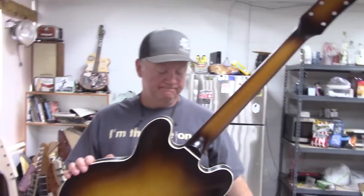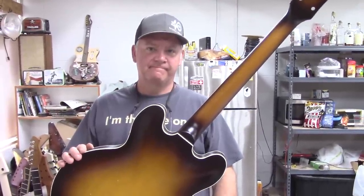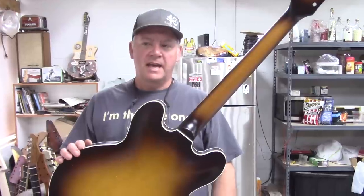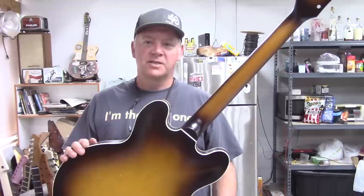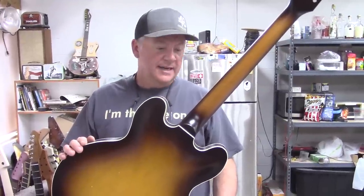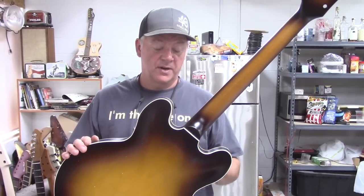All right, Chris, there are going to be people who ask, what about that guy who works for Gibson who uses bits of old bandsaw blades to scrape with? Yeah, I was thinking about him when I was doing it. I think this is one of those things where the longer you practice, the better you get at it. I don't have any bits of old bandsaw blade, so I'm using razor blades. And it just takes a little bit of time. I think it took me probably 15 or 20 minutes to do the backside, but I was also getting used to it. The front side will go faster.